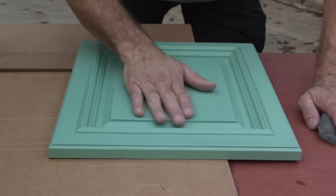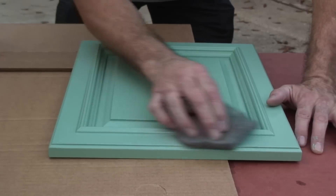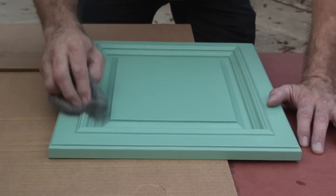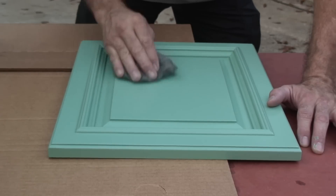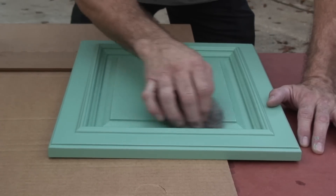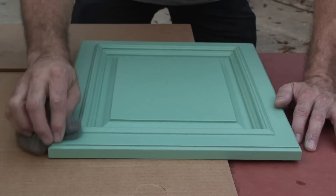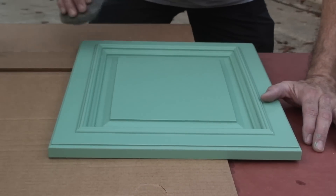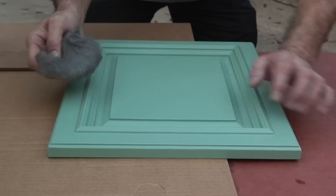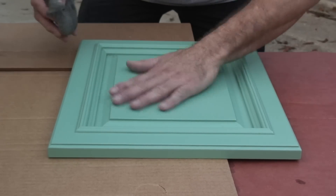This door is really, really smooth. All I'm going to do is take double zero steel wool and lightly rub it, just to make sure I get anything off that may have been on the roller — a hair or anything that happened to get in there. I just lightly hit it, then we'll go ahead and put the clear coat on. I'm going to make sure I get everything off of it, but as far as the little bristles from the steel wool, you have to make sure it's clean.